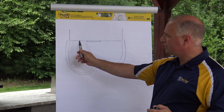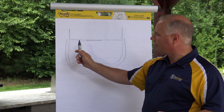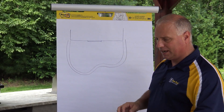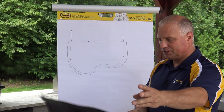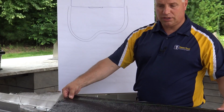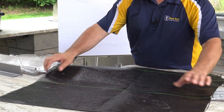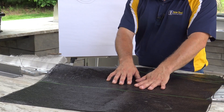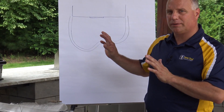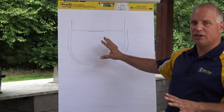That's 12 inches beyond. At that point, we want to lap our fabric up the edges. On an open grade base, if you go with your PICP — the Permeable Interlock Concrete Paver — and follow those specs, you're going to deal with either a woven fabric with real high tensile strength, or you can go with a felt fabric. If this becomes a driveway application, that's another whole animal. I'm talking backyard, patios, and walkways.